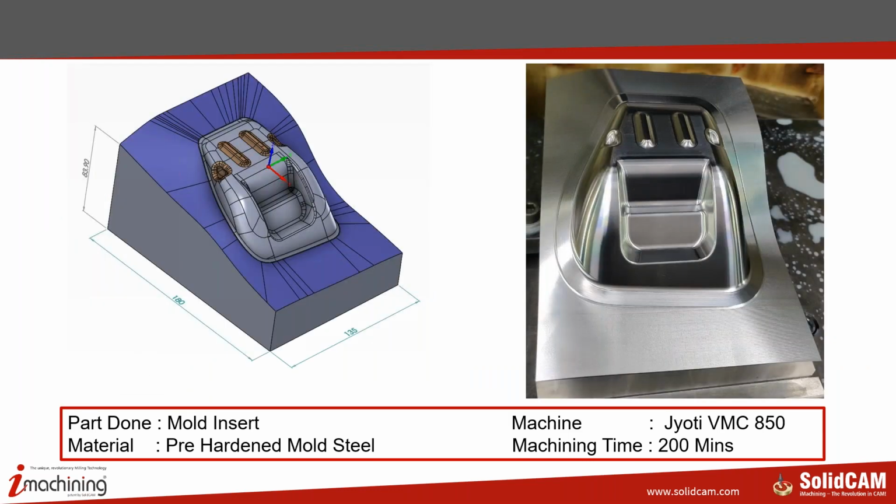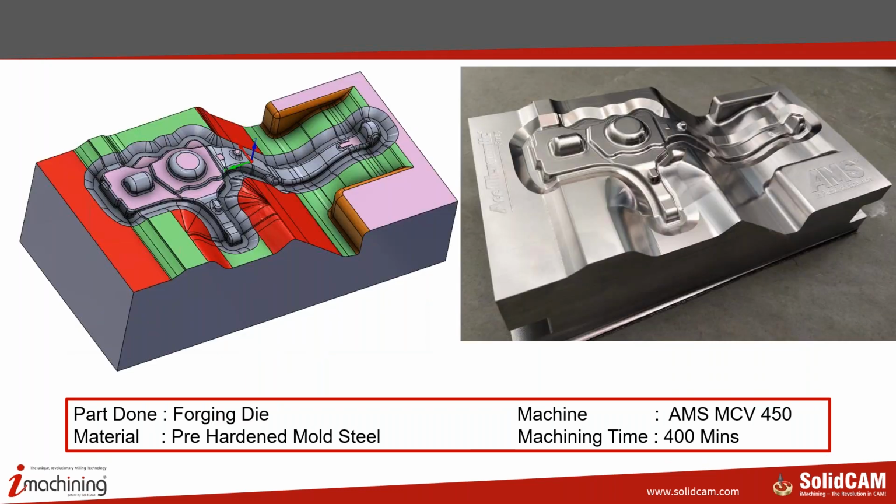We also did another part, which is going to be a part of our demo today. This was done again on a Jyoti VMC 850. Again, a mold insert, a pre-hardened steel, and machining time here was 200 minutes. And the last one that I would like to show you is a forging die that you see on your screen. This again was a pre-hardened mold steel, and this was done on an AMS MCB 450, and machining time here was 400 minutes for cutting this entire part.